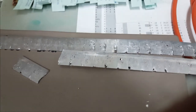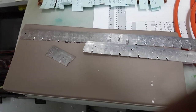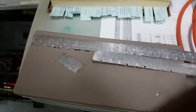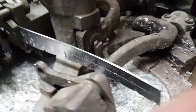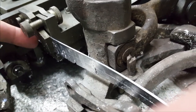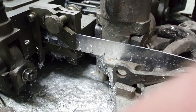It's not really melting from one section to the next very well, and I'm not quite sure what I have to do to get that fixed. This was running with no cooling water in the mold, so the mold should have been good and hot, and you would have thought that would let it fuse well. There are a few things I have to review — I wonder if I'm not getting good enough contact between the nozzle and the mold. I haven't done any special adjustment of the mold or nozzle height. On the mold, right here and here, there's a gate that gets cast on the side of the strip material, and there are cutters here to knock them off, but I'm finding they tend to jam for some reason.